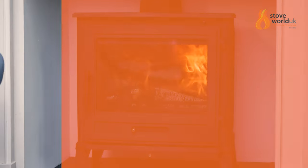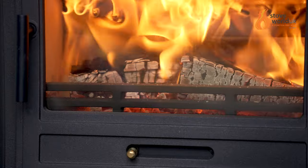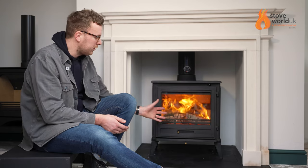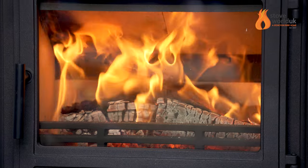Fuel. So this is a wood burning only stove. However, it is quite unique because it does have a grate and ash pan with a primary airflow on the front — something which is generally only required if you're burning smokeless coal on a multifuel stove. Usually with a wood burning stove it would just burn on the base with no primary air and just burn on a little bit of ash. This would be made like this mainly for practicality for the customer, because some people demand an ash pan, they like a grate, and they like the primary air. It's balancing the best of both worlds. And it's actually very useful with the primary air when you first light the stove to have all the controls fully open — it really takes off well and gets it established quickly. Then you want to close the primary air off and the wood will burn nicely.